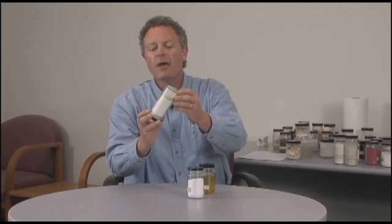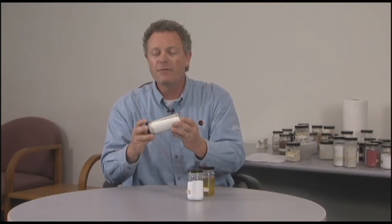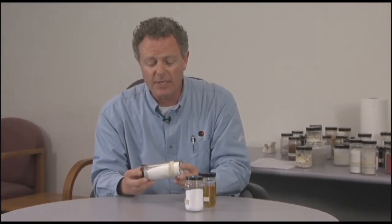What's incredible is that there are no lumps or balls. With free-fall processing, it's really important to respect the droplet size to the particle size and apply that liquid uniformly onto all the surface area.